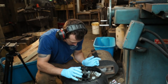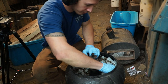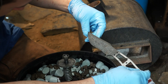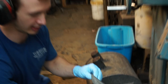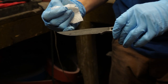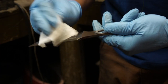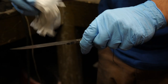It's been 90 seconds now — I'm going to find this knife and check it out. You can see that's a pretty good contrast. Let's dry this off and see what it looks like. Here's that stonewashed look — 90 seconds in the tumbler and this is what I'm going for. I'll put some WD on here to make it pop. To me it looks kind of like granite or marble — a really nice shiny look to it.